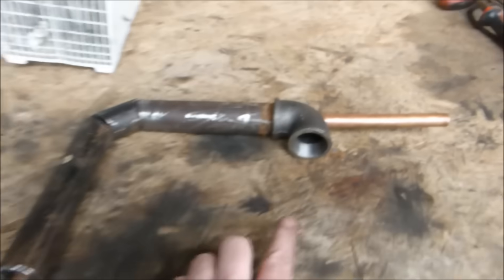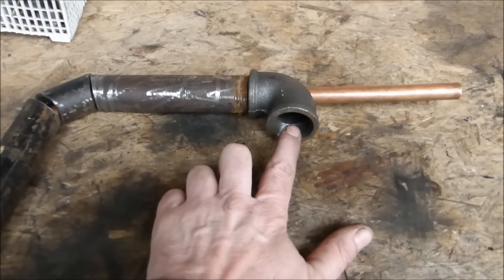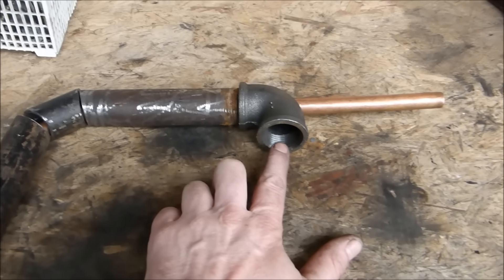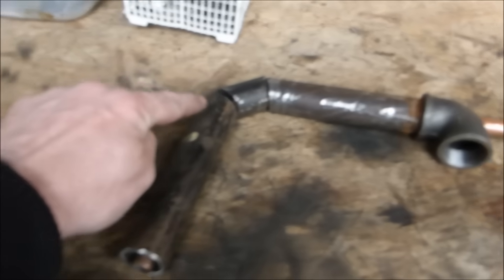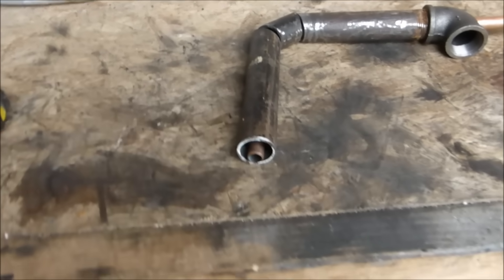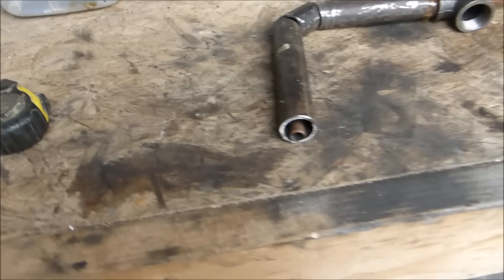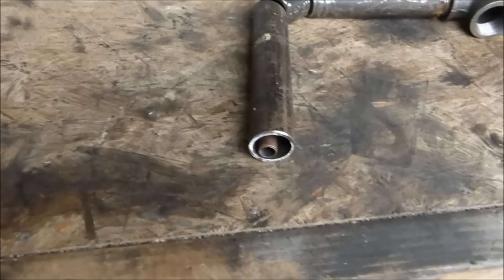So that's it. This one inch opening here gets air — I'm going to put a connector on that and connect it up to a blower. So air blows in here, goes round the corner, down this tube, and out here. That's going to provide the oxygen necessary for combustion, and the half inch copper pipe is going to provide the fuel for the combustion. Very easy.